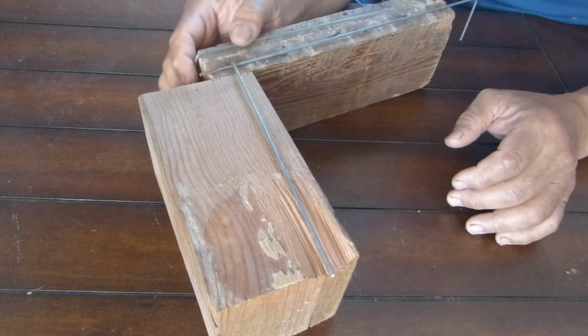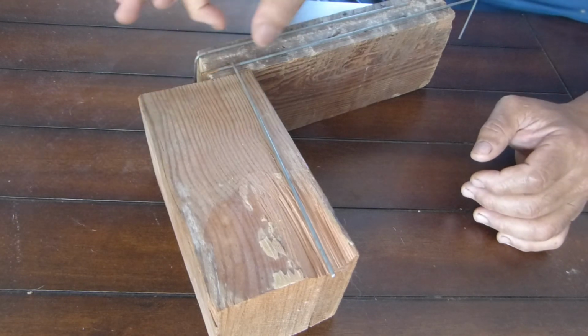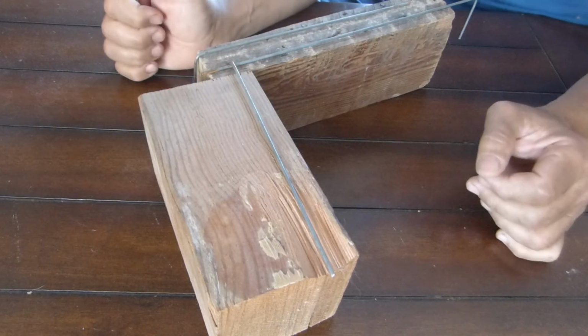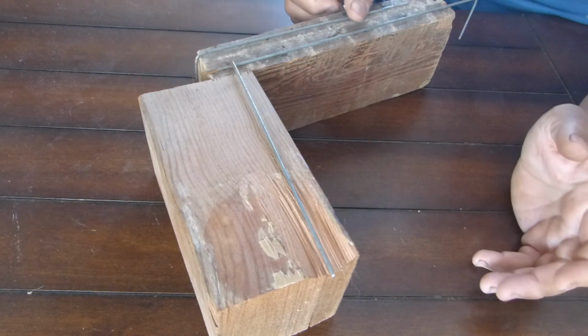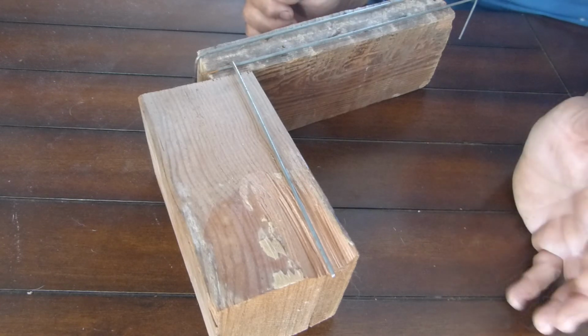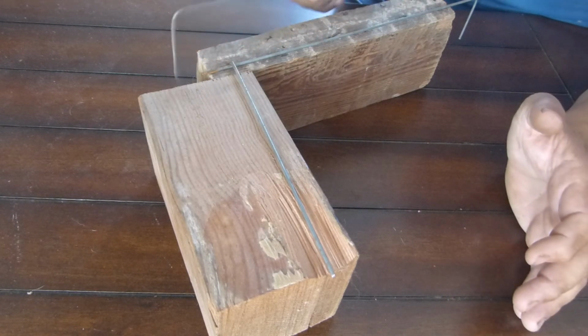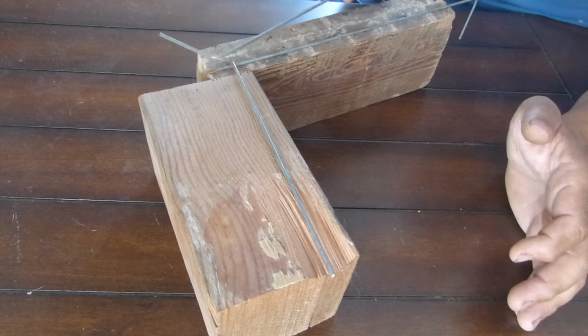Here's your 5/8 at the top, 5/8, and they put number 4 at the bottom. Again, section that all the way over to the wall. Went to the building wall, from the south wall to the north wall, the building wall surface. But you're going to get intercepted by the BMAs at the deck. You'll see that they then have their own 90s to them. They got turn-ups and then more 90s.